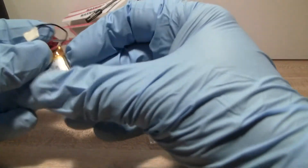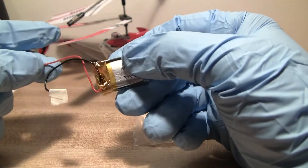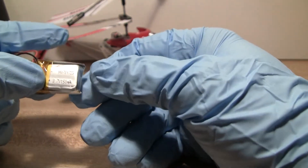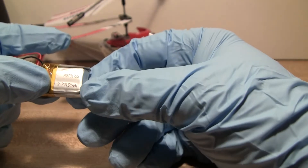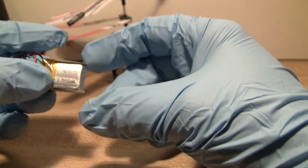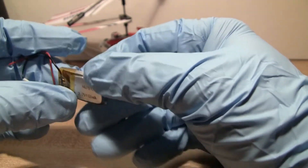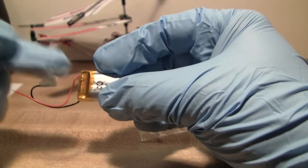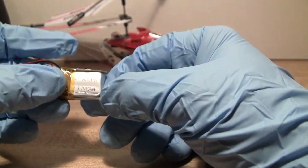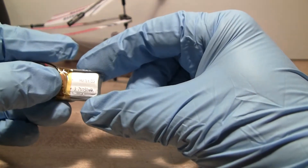This is what they look like taken out of the nose — they sit inside the nose. I had to desolder the old one, pull it out, re-solder, and put in the new one. I bought two of them, so this is a spare. It's 3.7 volts, 150 milliamp LiPo battery. LiPo actually stands for lithium polymer. Other people are buying the 200 or 250 milliamp version, which gives a couple more flying minutes but takes longer to charge. I decided to go with the stock one.